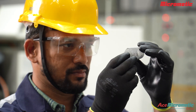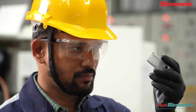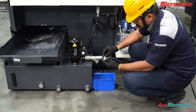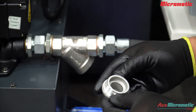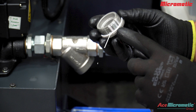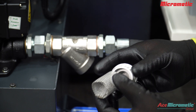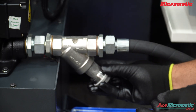After cleaning the mesh, carefully inspect it for any damages, pores, or signs of corrosion. If you notice any damage, replace the mesh to maintain proper filtration and coolant flow. Once it is clean, make sure the O-ring is in the cap, put the filter back, and securely tighten the cap.